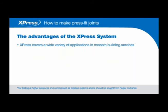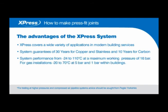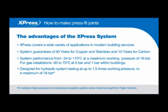XPress covers a wide variety of applications in modern building services. System guarantees of 30 years for copper and stainless and 10 years for carbon. Excellent system performance from -24 to 110 degrees C at a maximum working pressure of 16 bar. For gas installations -20 to 70 degrees C at 5 bar and 1 bar within buildings. Designed for hydraulic system testing at up to 1.5 times working pressure to a maximum of 16 bar.